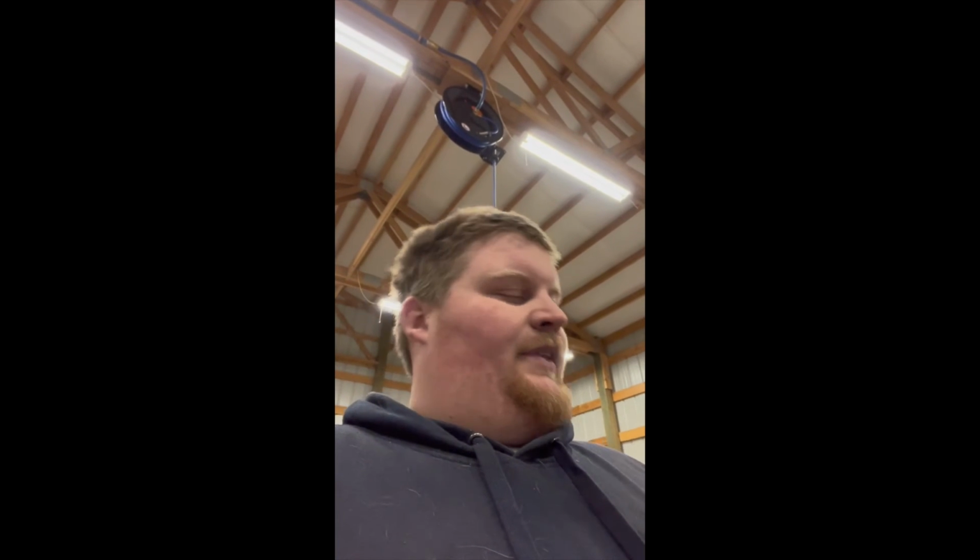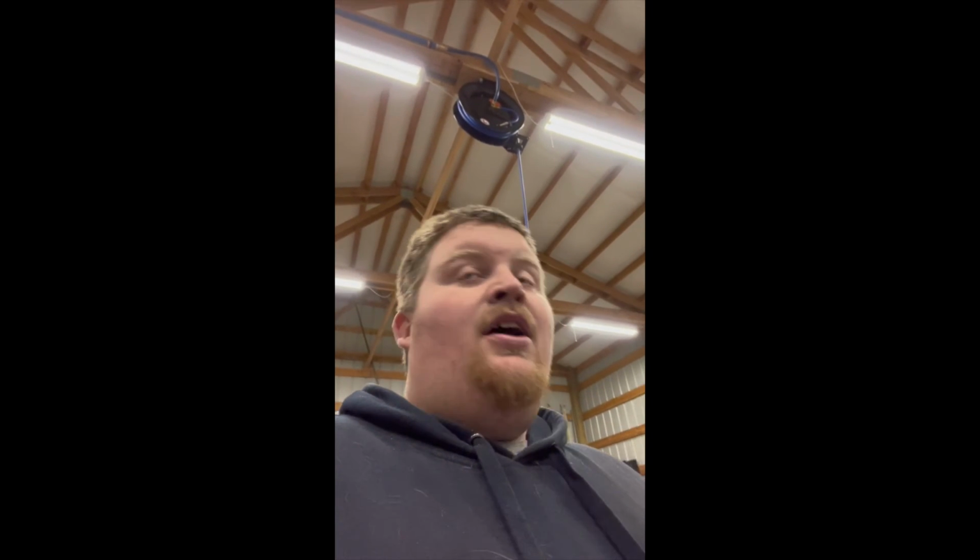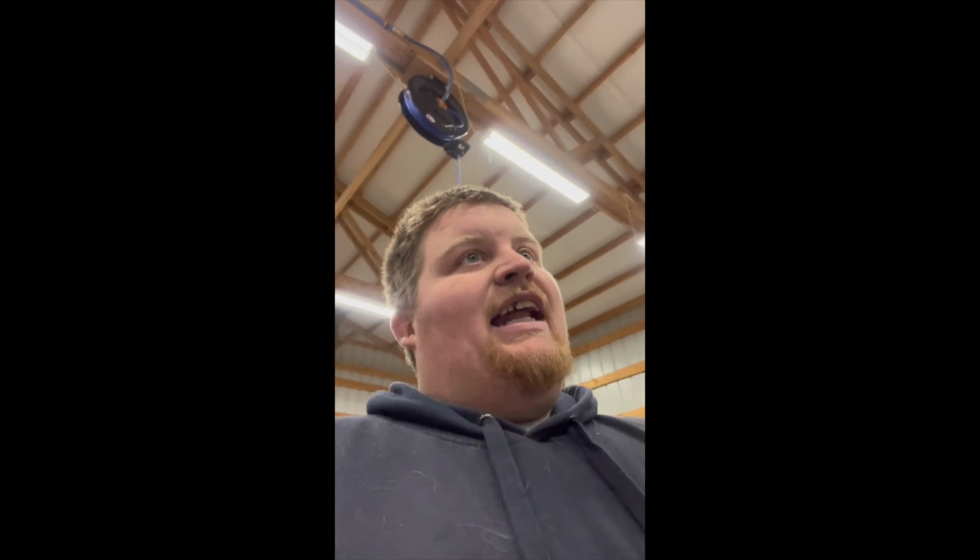It's definitely me. But the pulse setting anyway is more meant for longer welds and keeping your heat down. It's not quite meant for what I'm trying to do. That's something to think about before shelling out the money. With that being said, I'm glad to have this machine, but I'm really glad I did not fork out the $4,000 for the Pulse Miller machine, the 255, with the spool gun, which was another $1,200, only to find out Pulse really doesn't work that well for me. Never been able to find that sort of info on the internet.